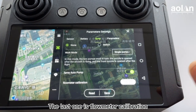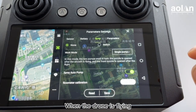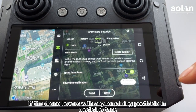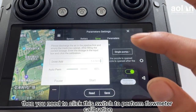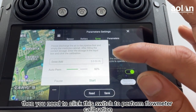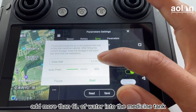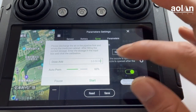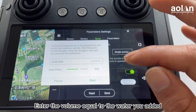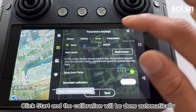The last one is flow meter calibration. When the drone is flying, if the drone hovers with any remaining pesticides in the medicine tank, you need to click this switch to perform flow meter calibration. After turning on the switch, add more than 6 liters of water into the medicine tank, enter the volume equal to the water you added, click start, and the calibration will be done automatically.